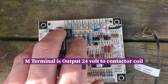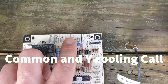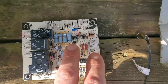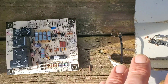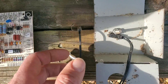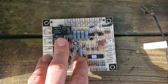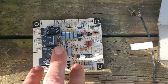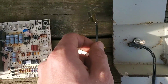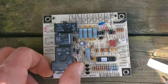I'll show you this on the wiring diagram, but first let's talk through it. You must have common in yellow, and you'll measure voltage with your multimeter to make sure you have 24 volts there. Make sure your pin is in the right position and that your resistances are correct — reference the chart for the temperature reading per resistance. If it's just about in line, those sensors will be good. Short across the test pin and it should go into defrost. Regular defrost happens when the coil sensor is at or below 32 degrees. On this specific model the defrost cycle lasts 13 minutes, or until the coil sensor reaches around 39 to 40 degrees — about 10 degrees higher — and then it'll come out of defrost. It's a demand defrost but it works off of time and temperature.